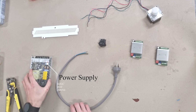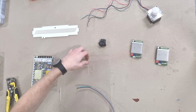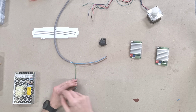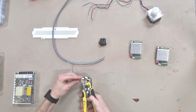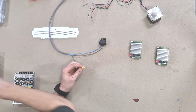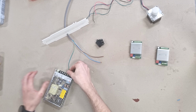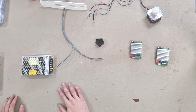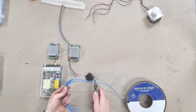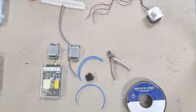The original design used a cheaper offline controller with a wired keypad, but the issue with them was they didn't accept all G-code commands. Most importantly, it didn't allow for pausing mid-program. I got around this by generating multiple G-code files for each part of the process, but it needed a lot of button pushes to wind one coil. With the Makerbase controller, I can set it to pause mid-job in the G-code, so the program will stop when you need to change the winding direction with the fish hook. Then you can just hit the play button to continue to the next step.